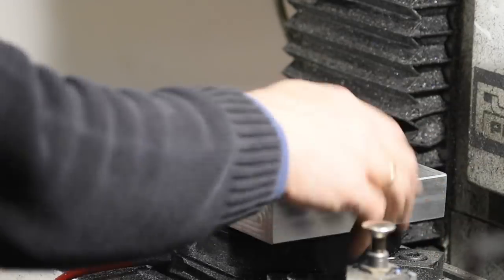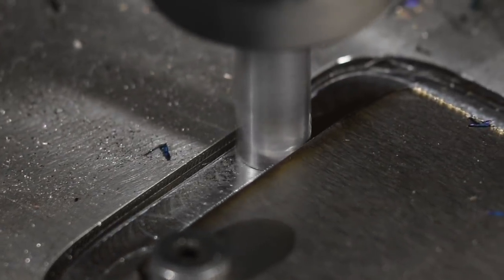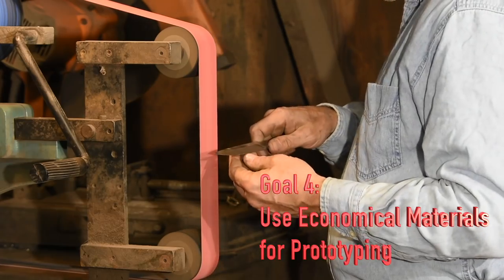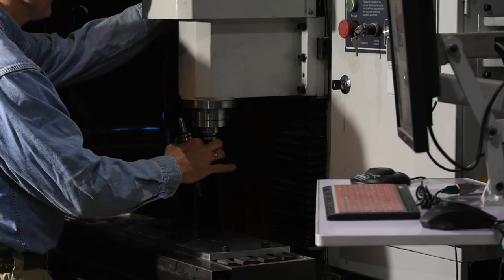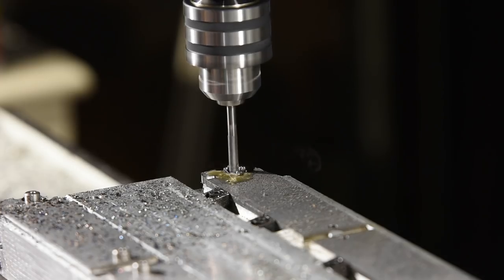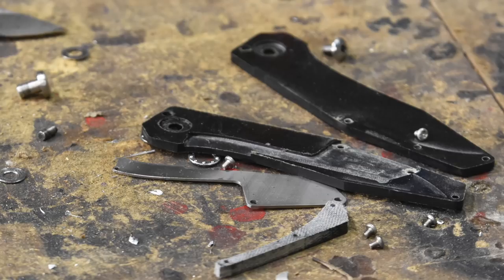That's not to say there won't be any handwork involved — of course there will. But basically the whole workflow has to be squared away ahead of time. A lot of what I'm doing right now is running something on the mill, testing it, finding out what's wrong with it, then going back and redesigning it. I also wanted to do something reasonably cheap to produce — the idea being fail fast, fail cheap. If I had started out making a really high-end knife with all titanium and a frame lock, every time you screw up you're scrapping a bunch of really expensive material. The idea here is to use more common materials on my initial prototypes so that as the prototype gains steam and gets better, I can upgrade to more expensive material, rather than throwing away tons of expensive titanium.